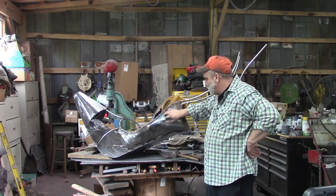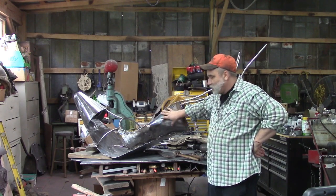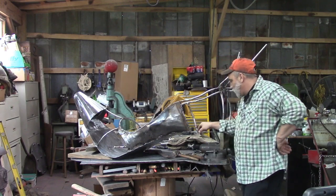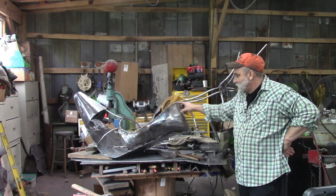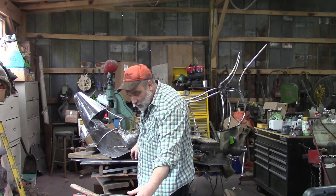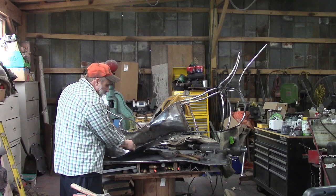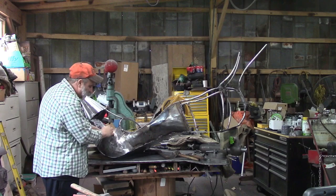I welded this piece on yesterday, and it really solidified the sculpture. I mean, it's really sturdy now. It was sturdy before, but this sole is only 1/8 of an inch, so it had some flexing to it. But when I welded these 3 sides, and I'm going to weld over here the 4th side, which is this. Something like that. And I'll weld it along here. And that way it'll have all 4 sides welded. And of course we'll weld it to the bottom and the top here.